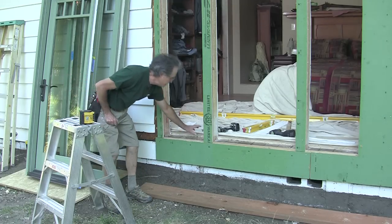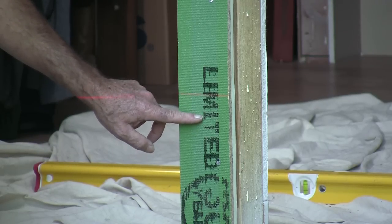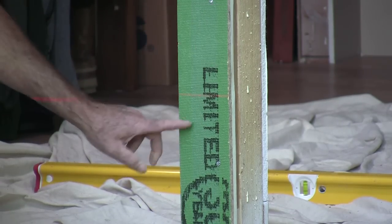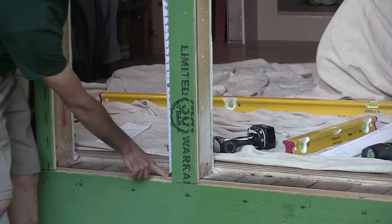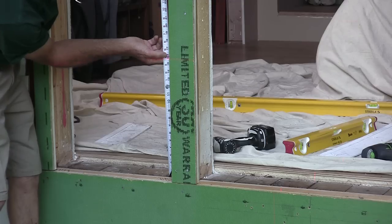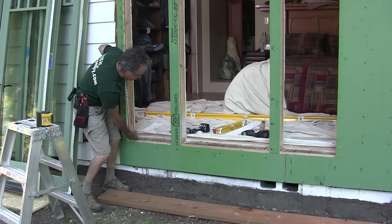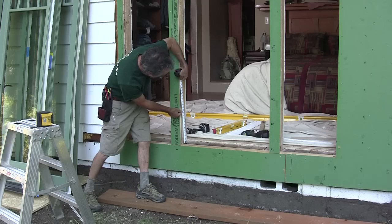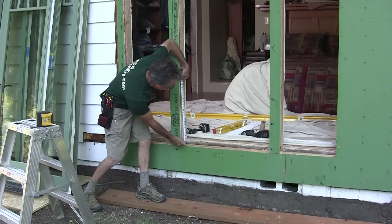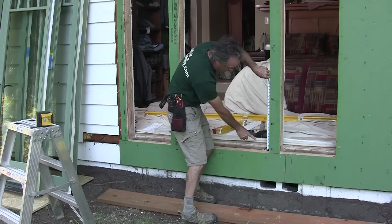I'm going to set the laser down and this will allow me to read right inside each opening with a tape measure. You can see the red line right on the zip wall here — I've installed zip wall on the exterior of the remodel. I want to measure to this laser line now: I'll put the tape measure down against the sill and read where that laser line is. It's at 15 and 5 eighths. Over here I've got 15 and a strong 5 eighths, so that opening is pretty level. But further over, it's 15 and almost 3 quarters — so we're falling because the number is bigger, meaning the floor is falling. And over here it's 15 and 7 eighths, so we've dropped another eighth of an inch.